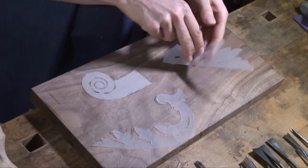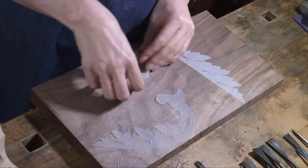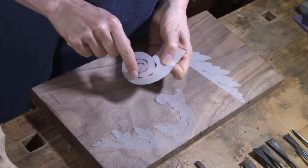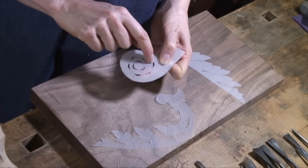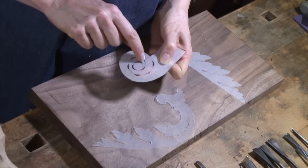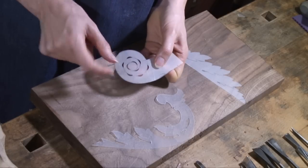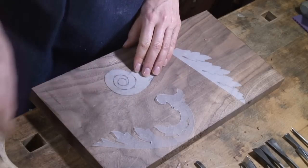You can take it and flip it for symmetrical carvings. This one is interesting — it's a scroll, and I took these little strategic notches out. This is the actual line I'm transferring along that edge, and then I take a slightly larger scoop out so I can fit my pencil lead in there and get an accurate curl or scroll. That comes in really handy when you've got a lot of inside details — then you just connect the lines.